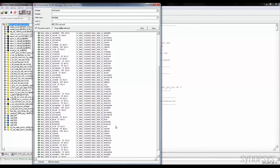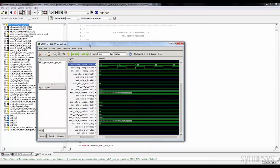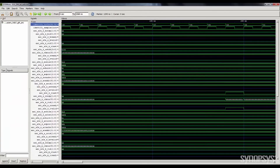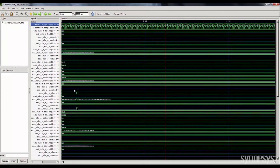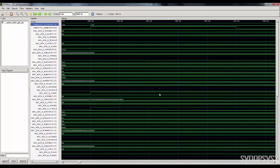The IP prototyping kit comes pre-instrumented to capture relevant signals using deep trace debug. This capability gives designers the ability to view several seconds of waveforms to speed up debug interactions. This is done by taking advantage of 8GB DRAM on the HAPS DX system. The DRAM captures RTL waveforms that can be viewed on popular hardware debuggers, such as Synopsys Verdi or most other waveform viewer tools.